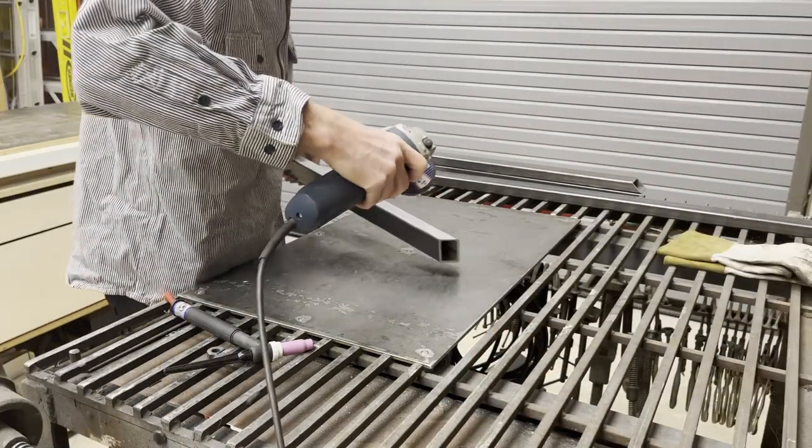Anyway, so I'm gonna go ahead and weld up, first, the doorway opening for the gate, and then the gate itself, the swinging portion. Those have to get cemented in the ground, so I'm gonna work on that first, get that put in the ground, and then it can sit for a couple days while I get the other parts prepared, and then everything else, the measurements will come off of that and go out to the walls on both sides. So I'll go ahead and start welding these and put together the first rectangular pieces without hinges, and then I'll add in the hinges after that.